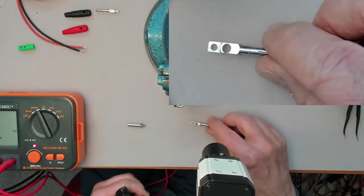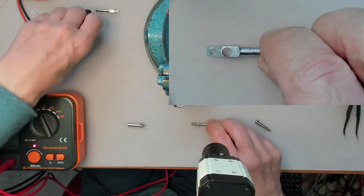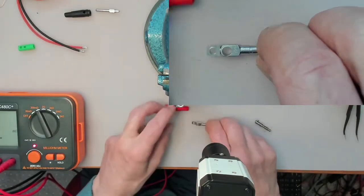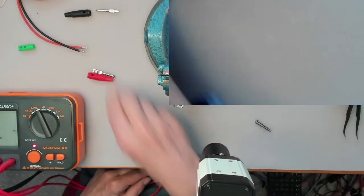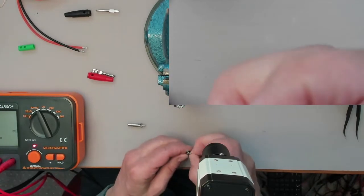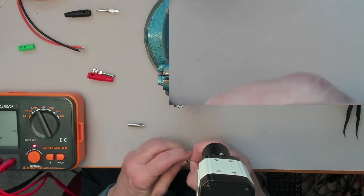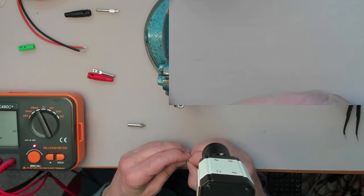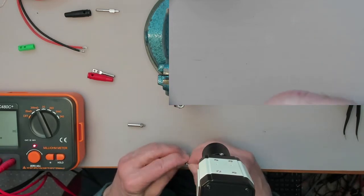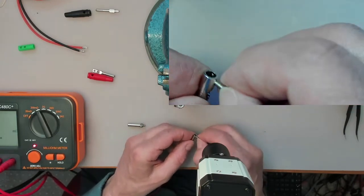We're going to be using these solid metal banana plugs, which get soldered, no screws, on account that these cheap banana plugs that you can find on Amazon, on AliExpress and so on, are very poor. For a start, the screws, if you try to tighten them up nice and tight, the screws come undone.